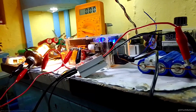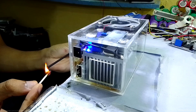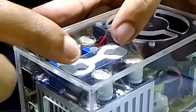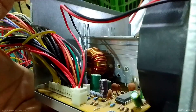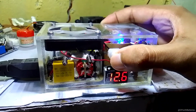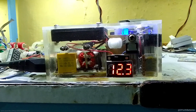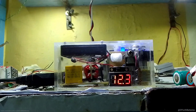After running it for a few hours it was blowing hot air from inside the box. To show how it absorbs air through the hole, I recorded a small clip using a smoke stick — you can see how fast it absorbs the smoke because there are no other holes for air to enter. The rest of the holes were sealed with plastic. Most computer power supply units have small holes beside the heatsink, transformers, and inductors because those are the main components that get hot, and the cooling fans blow out the heat. When the fan turns on, cool air goes through the heatsink, keeping it cool. Both converters and the adapter circuit are connected below the fan — heat rises upward, so it gets pulled away faster and cools the circuit as well. That's my simple design to cool every component that gets hot inside with a single fan.